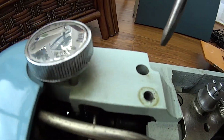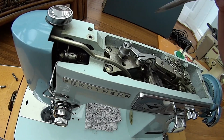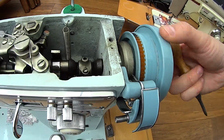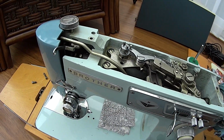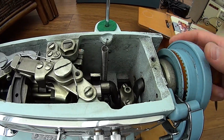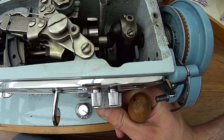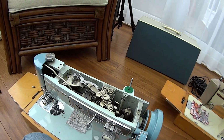And sometimes you'll look and you can see straight down through the screw holes which actually lead onto a bit that needs oiling. There's one there, for example, into the main bearing, one there for the main bearing at the top. So yeah, just oil all of that, and it'll be just like new. It will go on forever if you keep that well oiled. Sometimes you can oil down here, which is the reverse. This reverses the direction, so it's good to oil that, keep it free.